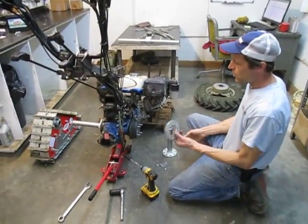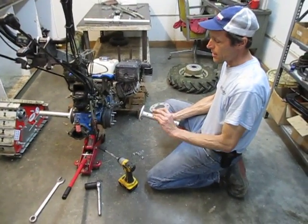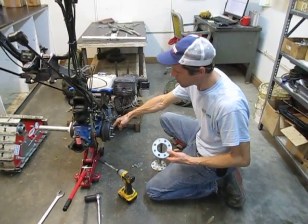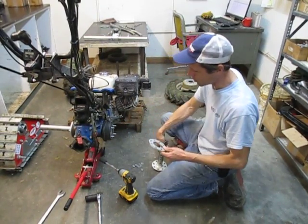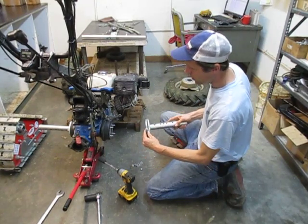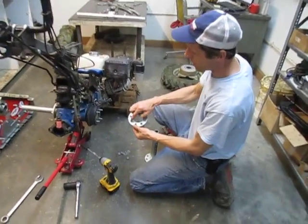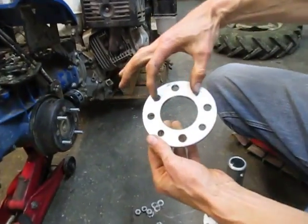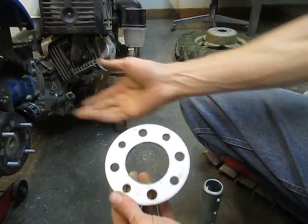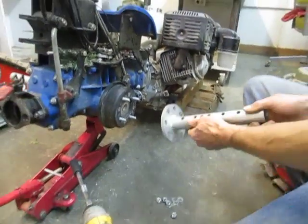With your set of tracks you'll receive not only the axle posts but an extra spacer. That's for the Grillo tractors — the Grillos have a hub bolt that sticks out of the center of the axle a little bit and needs extra clearance. With the Grillo you use that spacer and also the larger of the lug nut hole patterns. There are two patterns: one with smaller holes for the BCS because BCS has smaller studs, and one with larger holes for the Grillo. Since we're putting this on a BCS, I'm going to discard that spacer.